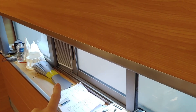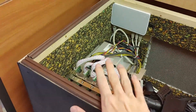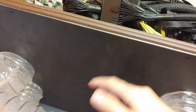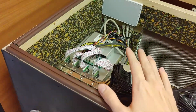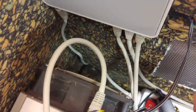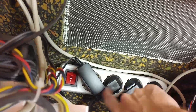It would just be a case of adding tubes here that go to the outside, so it's a closed system that pulls air from outside. You could have a filter there. In my case I have a HEPA car filter over there where it pulls the air in, and then it goes into here and outside. The machines do all the airflow work, and it does restrict airflow a bit — temperatures inside the enclosure are not as good as when the machines were just sitting out in the open, but as long as they don't thermal throttle, which they don't, it's perfectly fine.